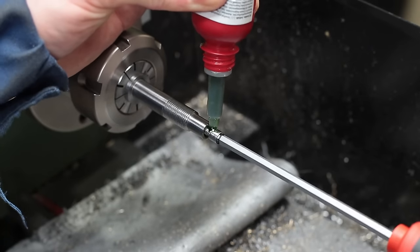In the end, I was curious what to expect from the new nut and checked the whole assembly for backlash. To my surprise, there is an almost immediate response on the dial test indicator when turning the handwheel — I can't see any measurable backlash. So all in all, I call this rebuild a great success. I hope you enjoyed this video, even if it's a little bit on the long side. Consider subscribing to the channel if you like more of this content. Thank you all for watching — until next time.